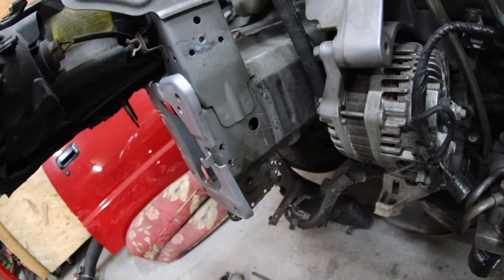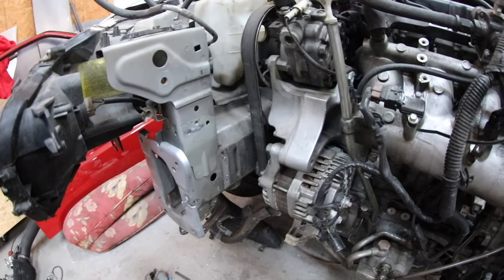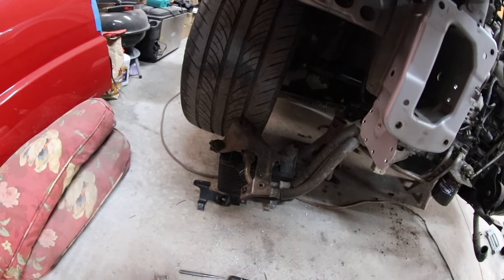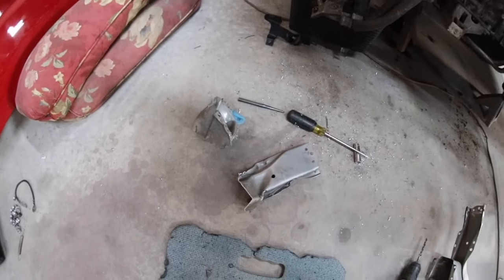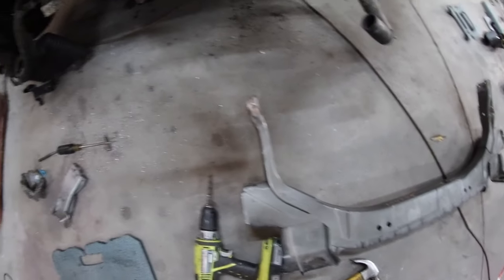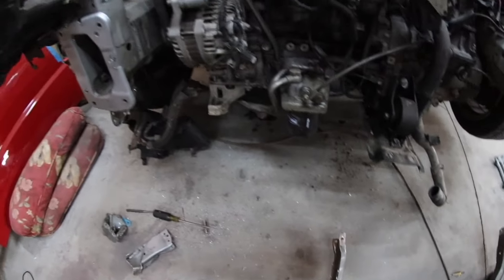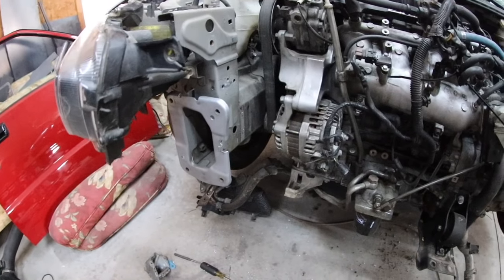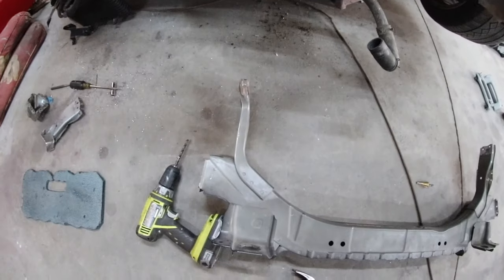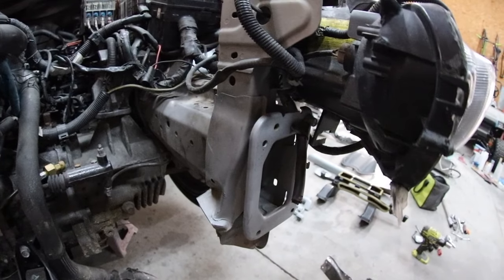One side down. I was able to get it off pretty clean. You can see it's a little tweaked from me using a flathead to get in there, but I didn't have to take any headlight off. I didn't have to take the alternator off — I did have to move the oil cooler down just on the bracket, set it down to the side. And you can see it came out in like two pieces, but I'm happy I was able to get it out. I actually set this here so I could look at it for reference, because I almost drilled out a couple spot welds I didn't need to. Thankfully I stopped before the hole even went all the way through. This side is going to be the same deal — drill out some spot welds, then prep both sides with the flap disc.